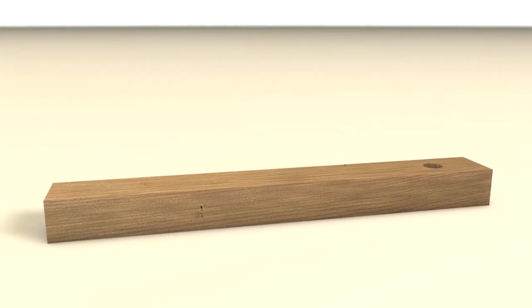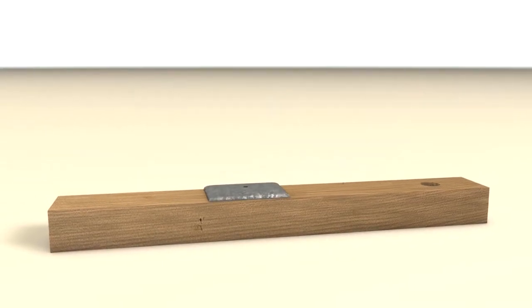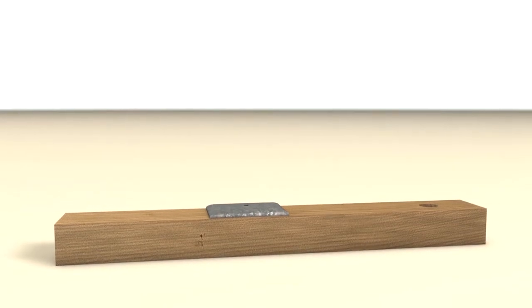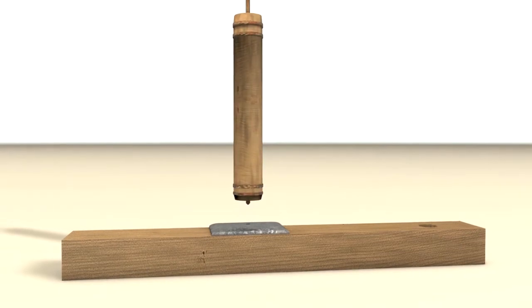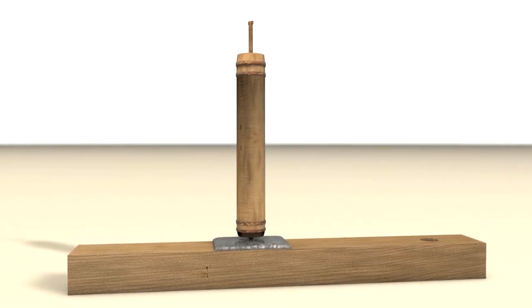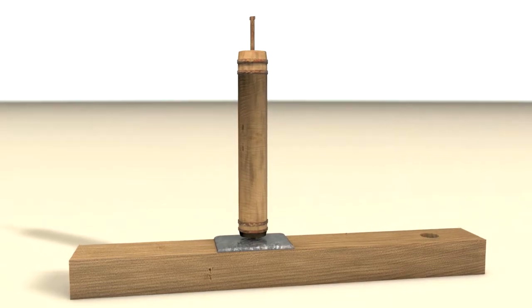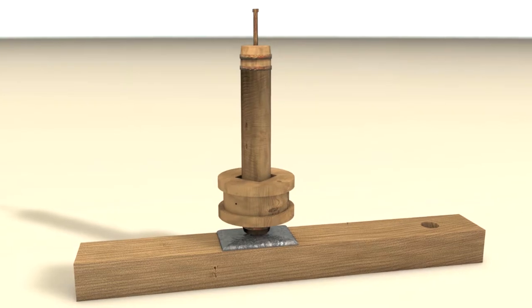A metal blade was screwed to this rectangular piece of wood, and a metal bullet was placed inside the blade hole. The spindle, a vertical wooden axis, rotated on this metal bullet. The bottom part of the spindle had a wedged iron post tangential to the bullet in order to withstand friction caused by rotation. The spindle had a perforated wooden part, the drum, which was battened down with a metal peg as well as wedges.